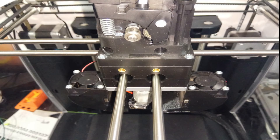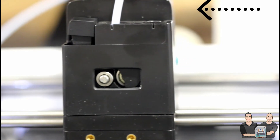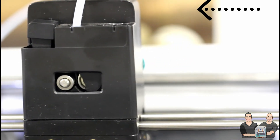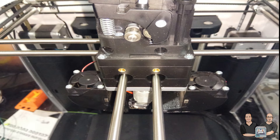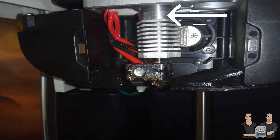Now let's see the same explanation with real photos of the extruder. The filament is pushed into the extruder by the drive gear, which pushes it against the bearing to help it move smoothly. While the drive gear is moving, it collects dust before the filament enters the silver column. The fans blow air on the heat sink to keep the filament cool so it does not melt before reaching the hotend block, which includes a temperature sensor maintaining a steady temperature. Finally, the filament is deposited through the nozzle.